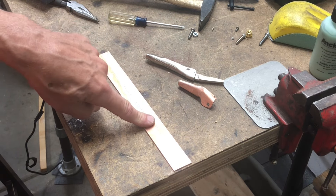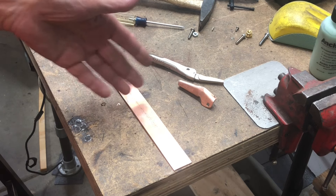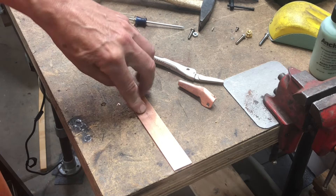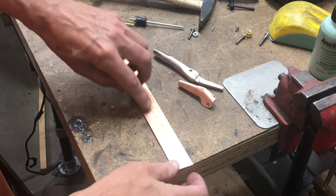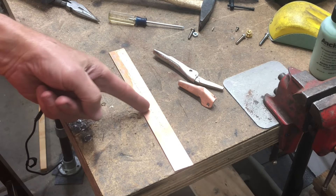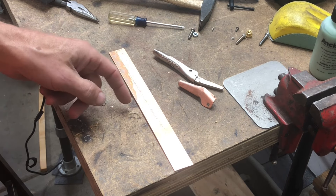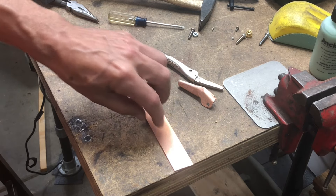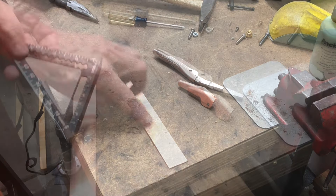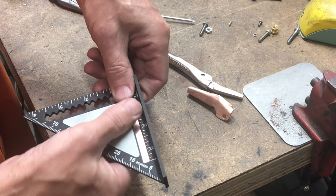The point at the grounding clamp end is ease of access. So I'm going to make it not huge but big enough so we can clamp it around and easily maneuver it to whatever we're going to clamp it to. I'm going to make it about three and a half to four inches long, bend up an ear and attach the cable to it. That'll give us plenty of room to get the ground clamp on it or arrange it however we want.